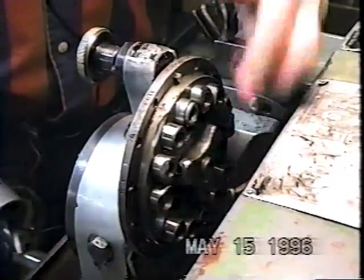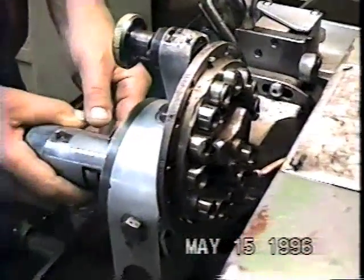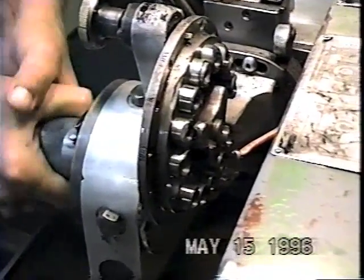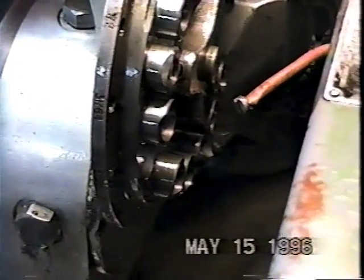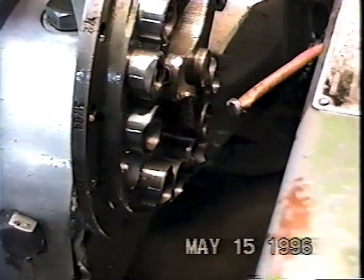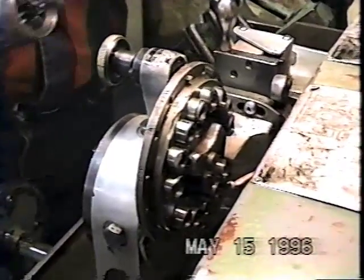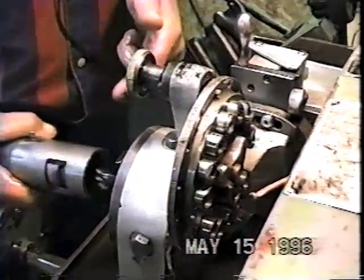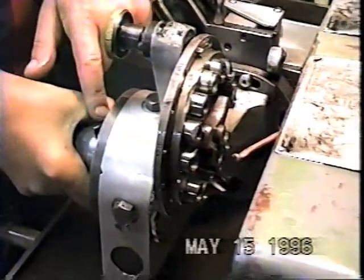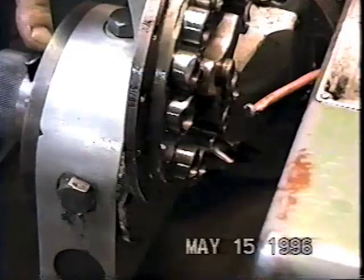What that does is we have 17/32nds on the top, the bushing is at the bottom. When I put the drill holder into the locator in the right position, the drill protrudes through the bushing holder and the bushing, and it should go at least the diameter of the drill. The purpose of the bushing plate and the bushing is so that when I take my drill and insert it in the bore located in the locator, my drill point sticks out of the bushing one to one and a half diameters. And that's what holds the drill in place for a perfect grind.